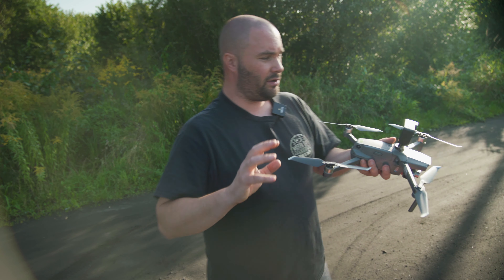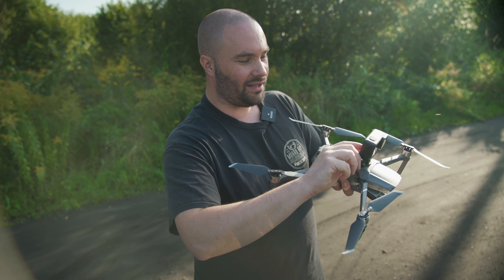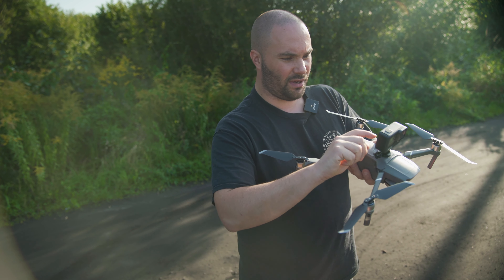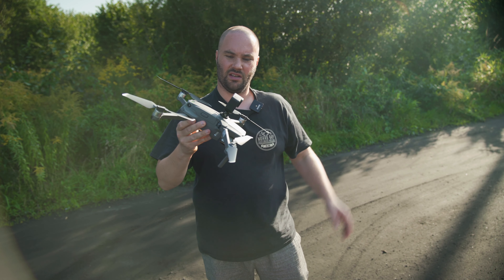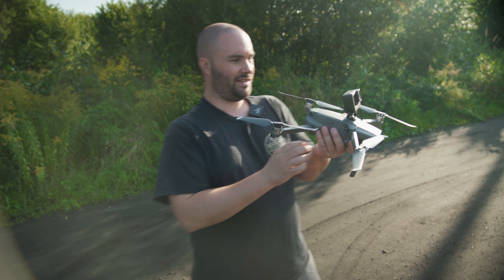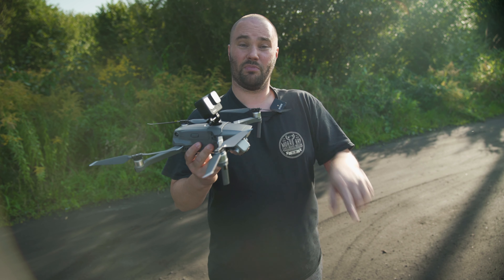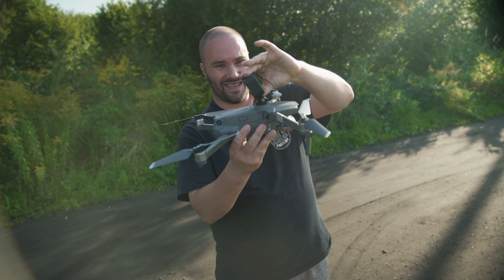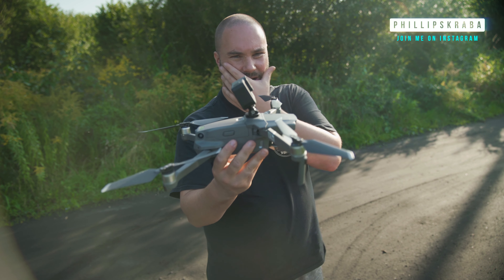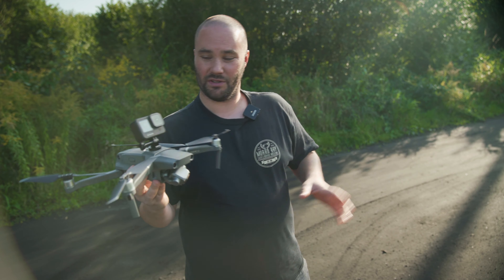The really cool thing with the GoPro footage is if you pull up and press play you can skim through it like you're fast-forwarding. What I've noticed straight away is that when the drone's flying it tilts forward like this, so I need to angle the GoPro to compensate so he gets almost a straight view. Also, if I have it too far down the propellers are getting into the shot just a little bit. I'm guessing it's about a 20-degree angle we should be using for it to look good. Let's get this up in the air and try once more.